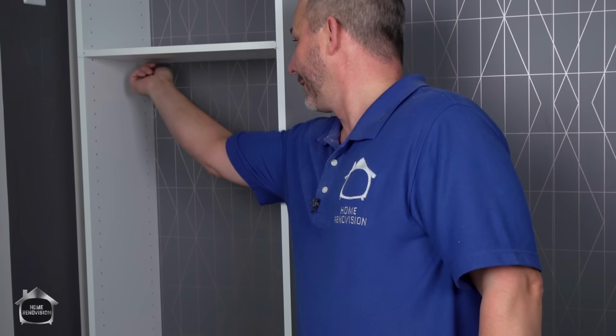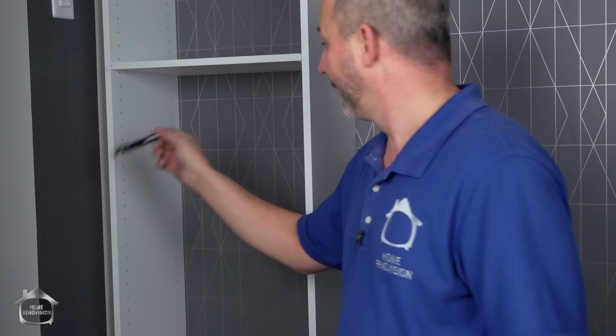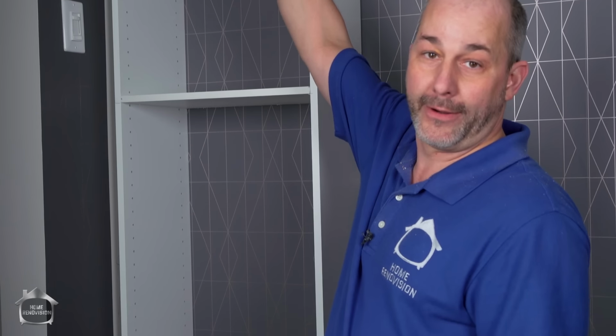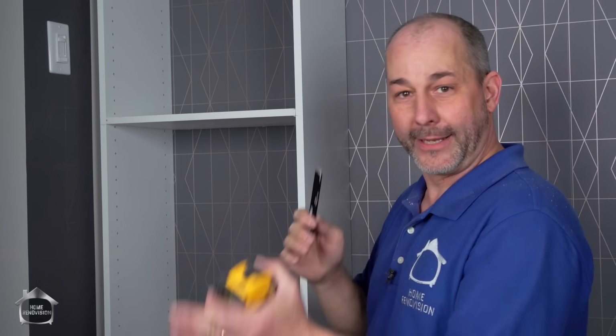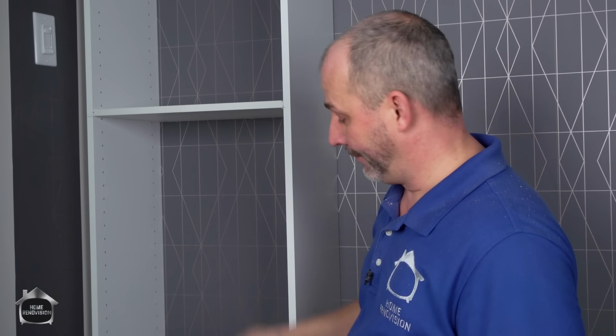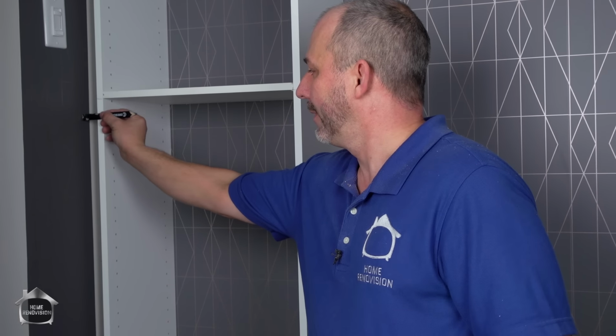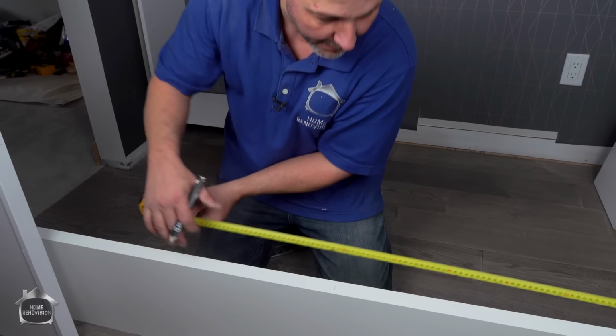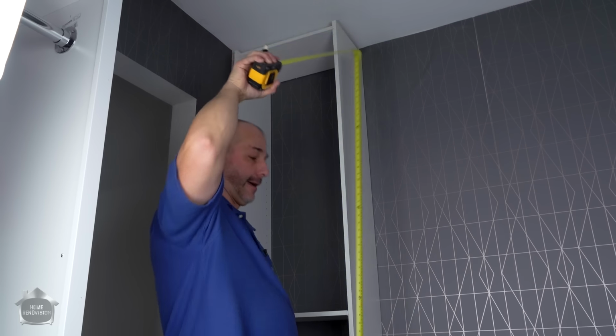So what we're gonna do, Matt's gonna cut me a couple of pieces that are 18.5. The 1x2, we're gonna install it as a nailing surface underneath the shelf here and underneath the shelf at the top. We're gonna throw a laser level on, get this perfectly in line, and put our piece of 1x2 on the side here. Just a couple more details, and then you'll be able to make miles and miles of this cabinetry. Okay, 92.5.